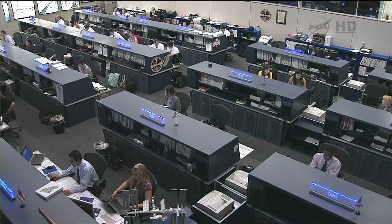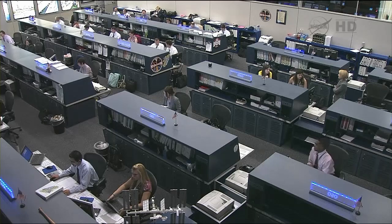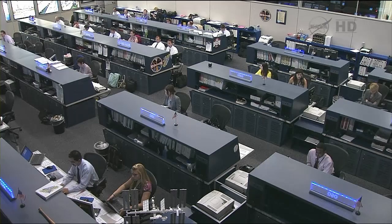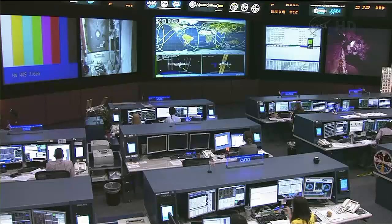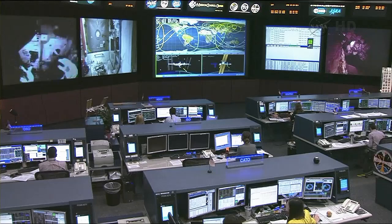You leave the same settings and go for the center fastener, 28 to 31 turns. Remember, there's no soft dock. No soft dock. Same settings. Bravo 1, counter 2, confirmed. And I am ready. Max torque to break it was 5.5. There's 6 turns for 30. Almost no running torque at all.